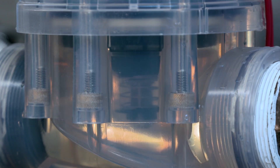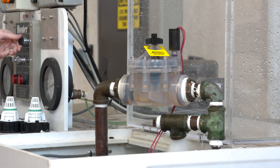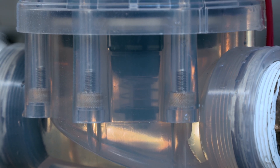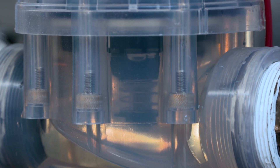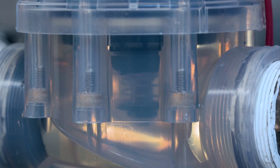Shown here in clear polycarbonate, the filter-sentry scours the filter clean with a strong wiper that slides up to cover the entire screen when the valve opens, as well as when it closes. The wiper continues to effectively scrub the upper part of the filter during valve operation.